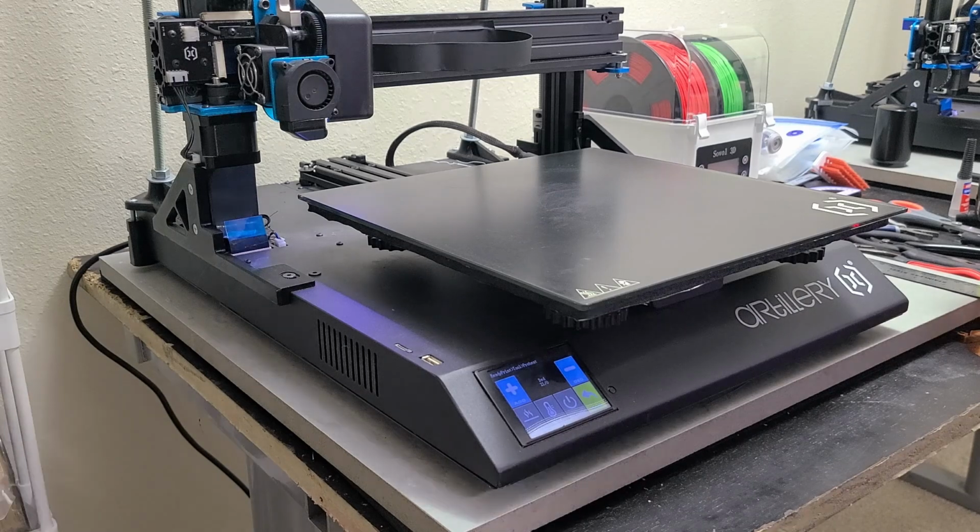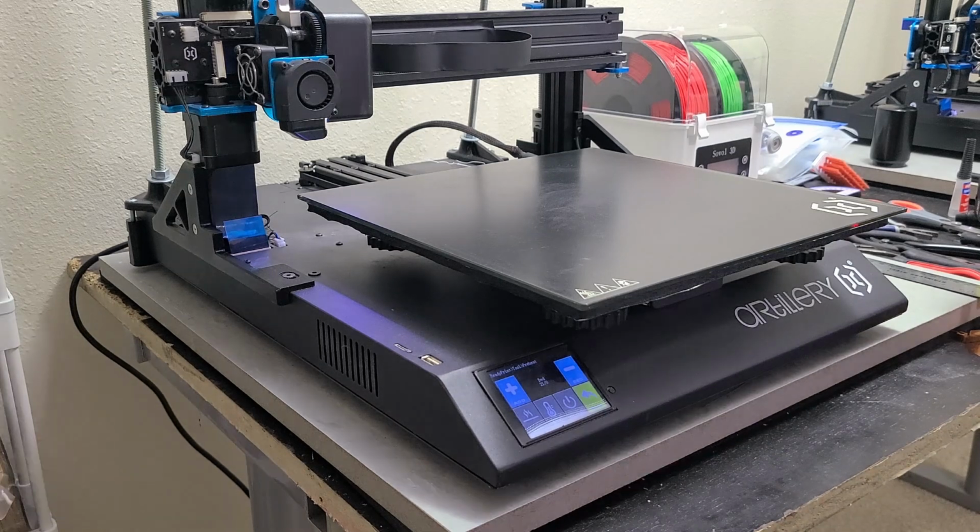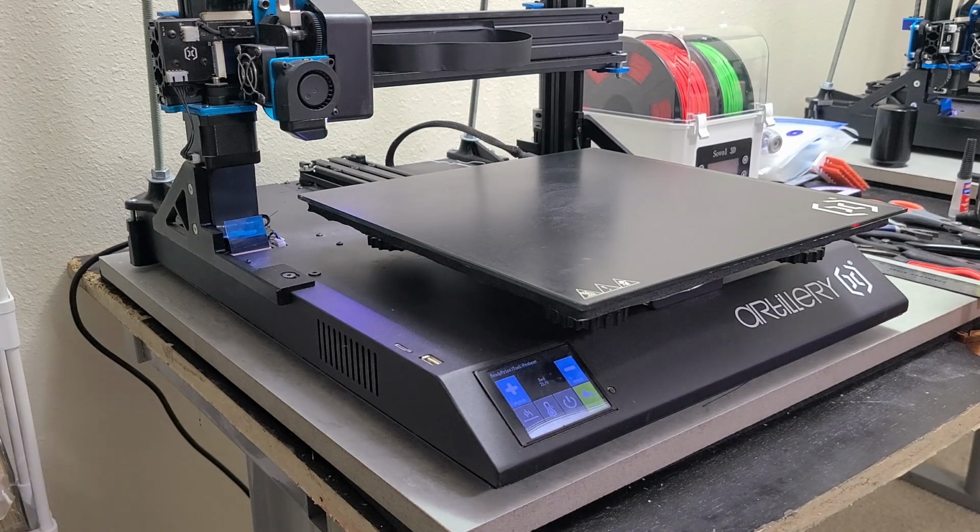So what I do is I always do the 91% isopropyl alcohol wiping in between and before each print. Then if I find out that I'm starting to have adhesion issues because I've accidentally touched the bed a few times and parts just won't stay on, I get some Dawn Power Wash and use the Dawn dish soap power wash to clean the bed off, and then clean that off with alcohol. That should leave the bed as clean as it can be. The dish soap will get your finger oils off the bed if they get baked into it, and that'll fix adhesion issues most of the time.